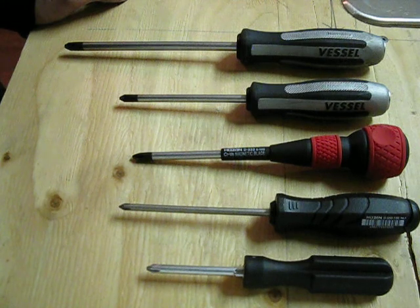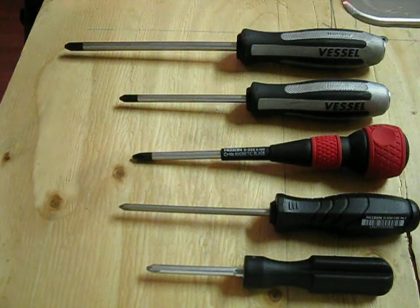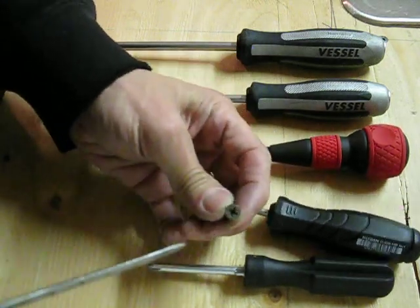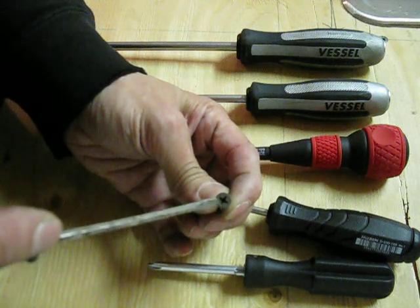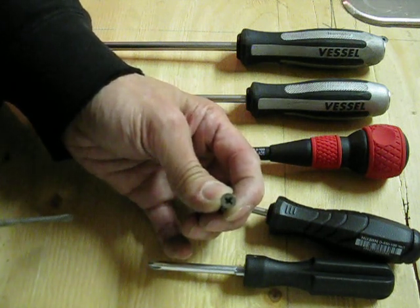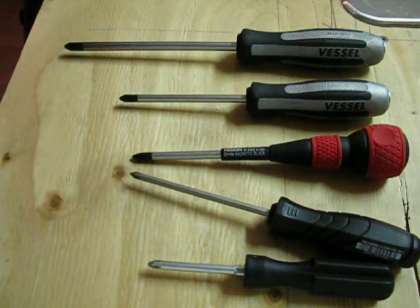Anything from Japan or a Japanese brand uses JIS, and here's how you can identify a Japanese screw head — they're not always marked, but when they are marked, you look on the screw head and on one of the ends you will see a little dimple, a little dot, or some type of small mark on one side. That tells you that it's a Japanese standard, not a Phillips screw. That's your way of knowing for sure, but like I said, they're not always marked.